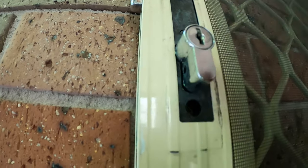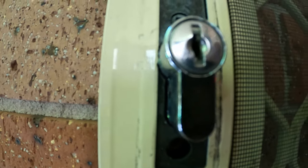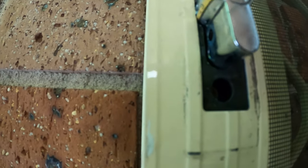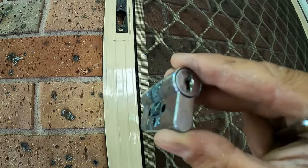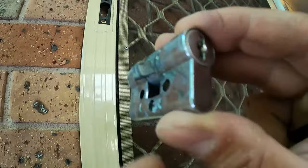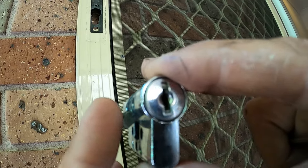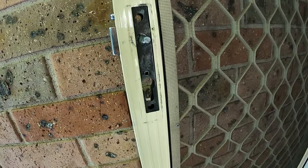I can see that cam starting to move now. We're just going to keep moving this down — and there we have it, everything's out of the way. We can now pull that cylinder out. You can see it's a pretty old cam; it was sitting out on the side, and we manually pushed it back down with the pick so it's out of the way. Now we can remove the old euro cylinder.